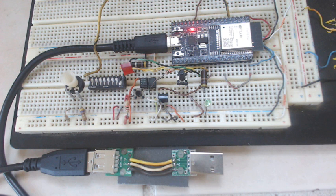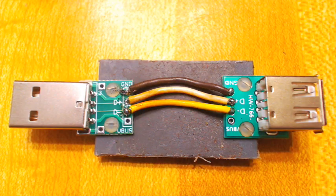As a general rule, I use this system as a developmental system and never disconnect the cable from the little processor — that way I don't risk breaking the connector on the processor. Total cost? Glad you asked — under $15, including the nylon screws. The plastic was free; I just used a piece of scrap plastic. So this little device costs next to nothing and allows me to do everything I need to do with the Espressif controller without worrying about putting power through the cable or accidentally connecting two power supplies.